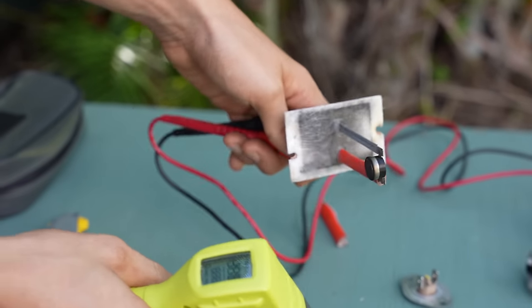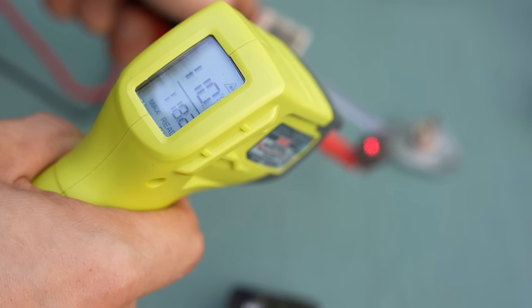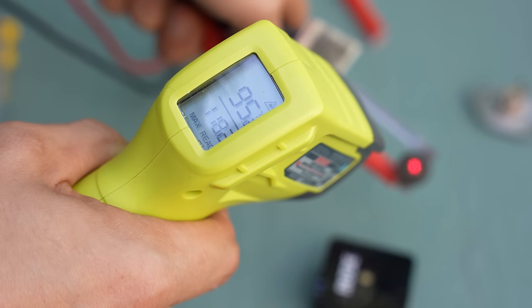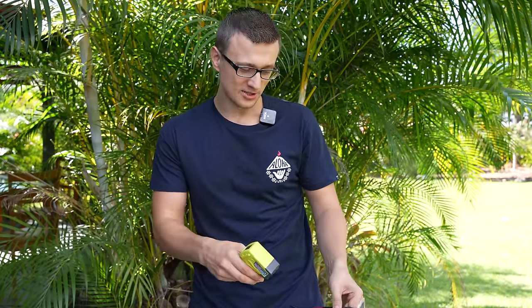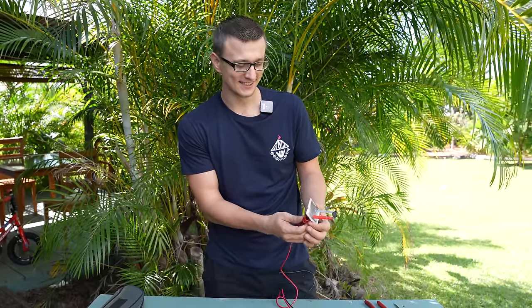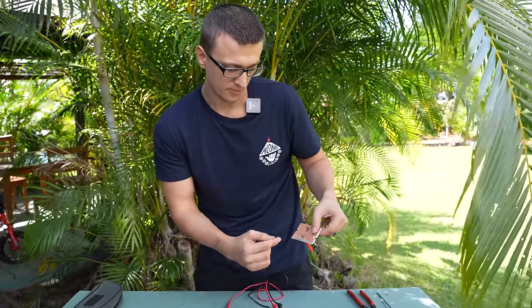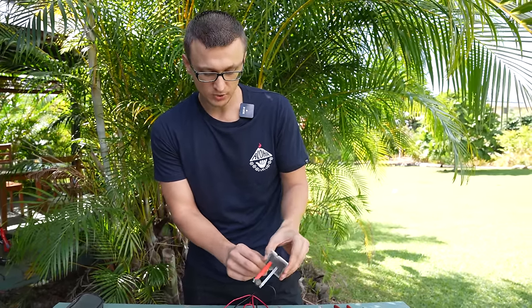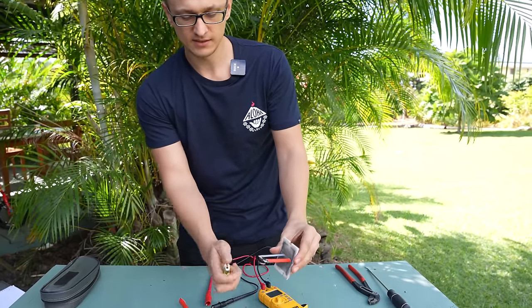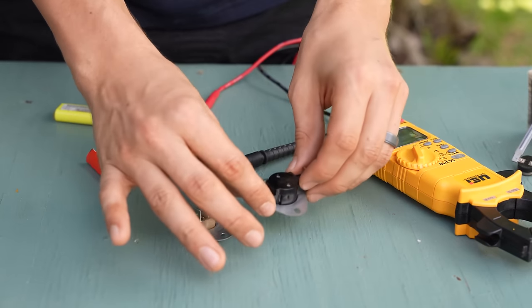That snapped — it tripped. Unfortunately I can't catch the temperature with a temp gun because the air is blowing across it and just skewing the numbers. According to the reading it reset at 90 degrees, but I highly doubt that — inside of there it was probably hotter. This switch is not a faulty switch, so it basically tripped at 200 degrees and should reset at 160. We won't be able to monitor the temperature that way, but we do see how it works — how when I overheat this thing using a lighter, it trips and opens that switch up, and when it has time to cool off, it resets and we hear the beep on the meter again.